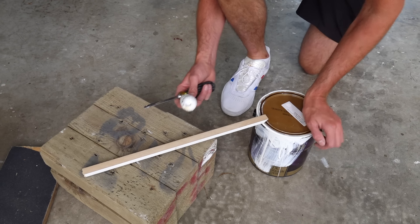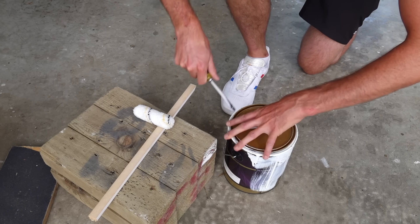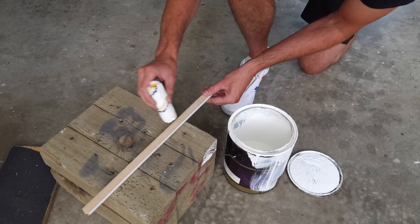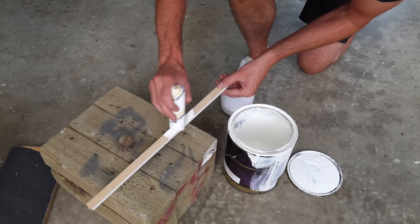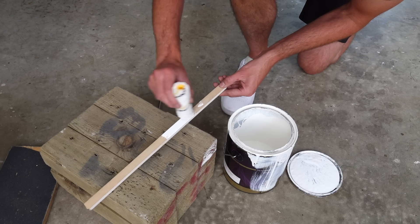To do the rest of this repair we're going to use a mini roller. In my other video I used a paintbrush, and you can get mediocre results with a paintbrush, but it can be really hard to not leave a lip and to not let the repair get too spread out. So I think I'm just going to use the very end of the mini roller to dab in. I've dabbed a little bit in there, and then to stop it from being so thick I'm just going to dab this around — it'll also get off any fibers. I'm kind of saturating the end of this and it's leaving a bit of the texture that we want to see.